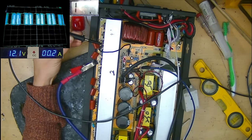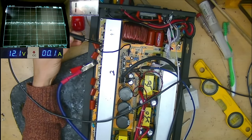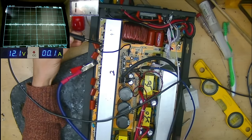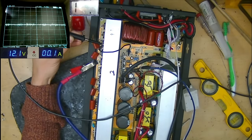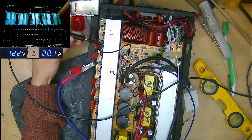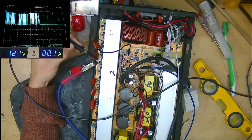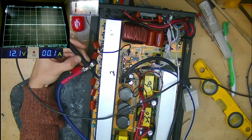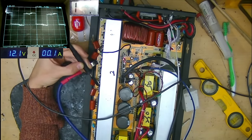Okay, well, it's drawing barely any current, which is quite a surprise. Wasn't expecting that. I thought we'd get an excessive current draw, seeing as this is pretty beefy stuff and we've got low voltage, which might upset the inductor circuit or the filter network or something. But as you can see here on this side, we do have our kind of PWM version of 50 Hz. And if we go along to the other side, you can see there we have our hard version.